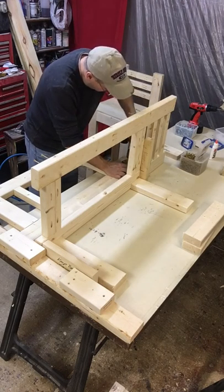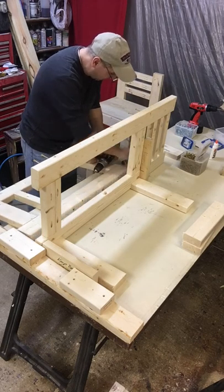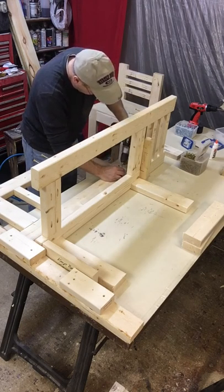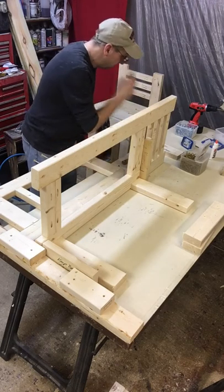And sometimes, if you hear it start to crack, back off. Drill yourself a pilot hole. If you give it some manhandle, you're going to crack it, and it's going to make it weak. You're not going to be able to use it at all. So, take your time.